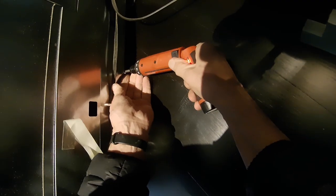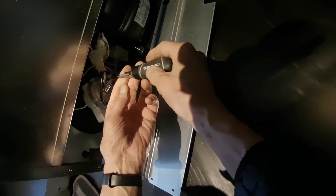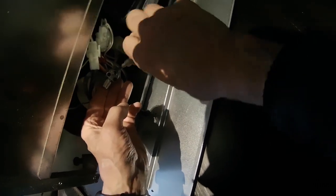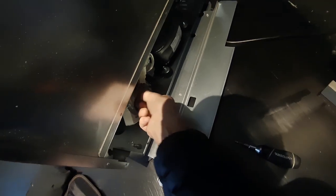This is a fairly new machine. We've got a process port right here. We'll put a tap valve on here temporarily because we've got to determine what's wrong with this. I'm pretty sure it's got a Freon leak. Make sure you allow yourself enough room to cut this off and solder on a process port. Right now we're just doing this to check the system — see what's going on because it's running and not cooling. I did a diagnostics on it and it suggested it was in the sealed system. So let's find out.